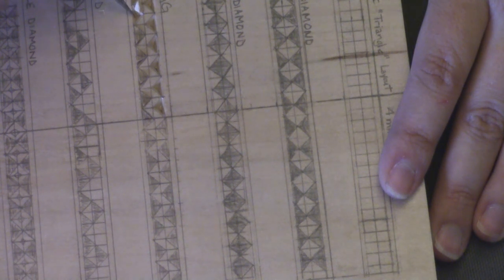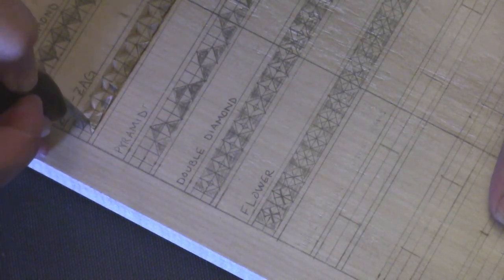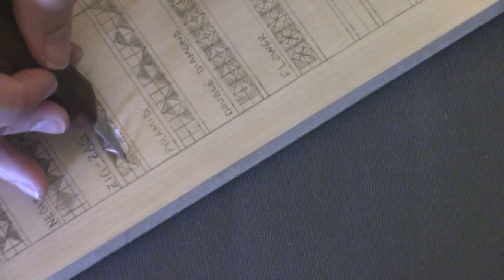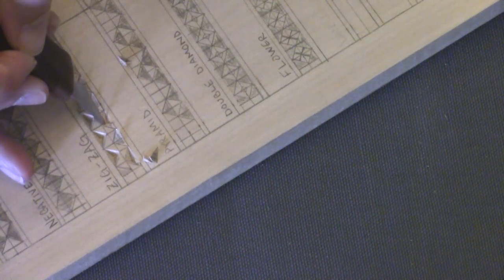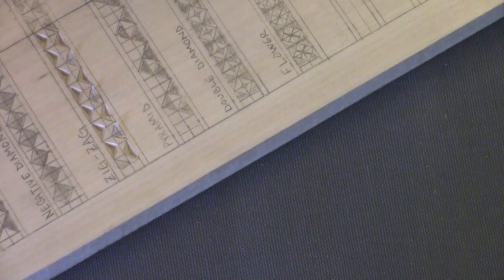And it's very tempting to take your knife and try to pull these off, but you don't really want to do it because there may still be some fibers stuck in there and you could accidentally remove extra wood that you didn't mean to. But a lot of times what I like to do is take my knife and feel where it's still stuck, and I'll rotate my board to just kind of retrace those steps. And you know you've hit it when you hear that popping sound. Sometimes the chip will pop out entirely like this one just did. I like using a small brush or, you know, blow the chips out when possible. Try to make sure you can still see this. Okay.